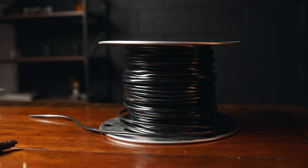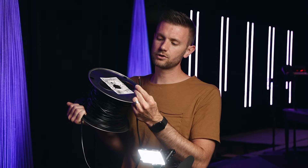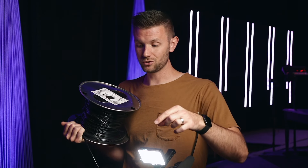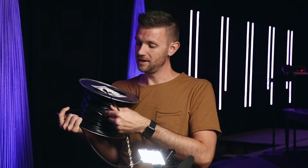What's really cool is I found this jacketed wire that has five individual copper wires in it. They are color coded — blue, red, yellow, green, and white. The colors really don't matter when you're using it for just power. The main thing is that you make sure you're not taking a V-plus to a V-minus. Also, what's great about this wire is you can use it to lengthen your LED strip — the wires on the end of your LED strip, you can butt splice or solder that to these wires, and this will be your run that lengthens them all the way down to the decoder.